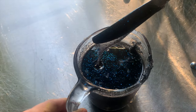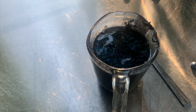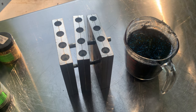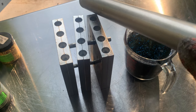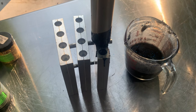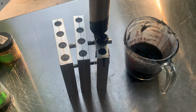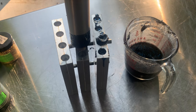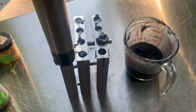We got our color right there looking good. Now this is ready to inject into our molds. We got our plastic ready — these are my swim bait molds, that's what we're going to inject today. We're going to use our glove of course. I've burnt myself a couple times and it is not fun. Some people say they have issues with denting — all you got to do is make sure your plastic is up to temp. I like to inject at maybe 300 to 310 degrees. Make sure you hold steady pressure. You basically just have to learn your mold and learn how to inject it because every mold is different, and once you do that you should be able to get the hang of it.